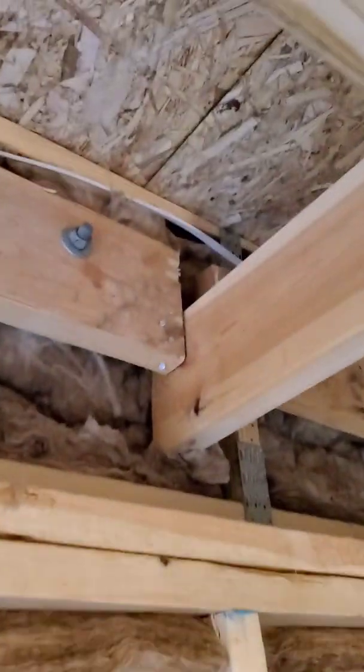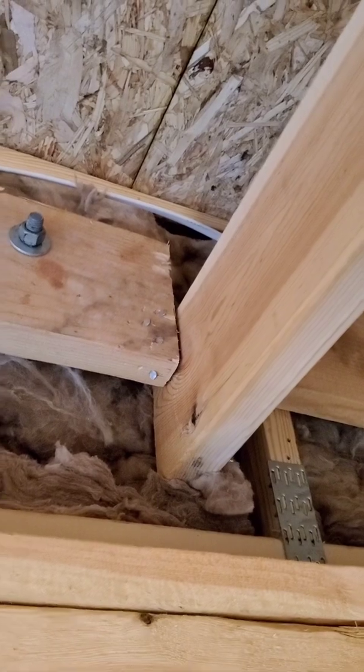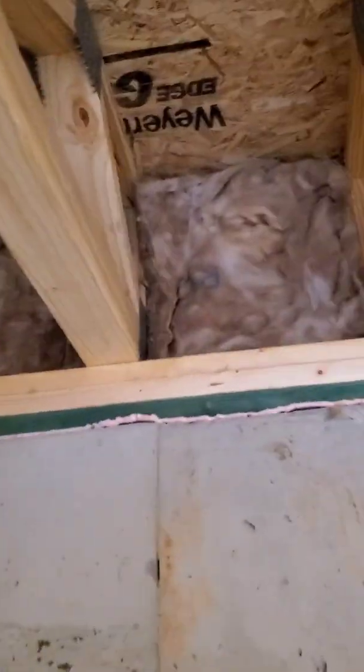So stay tuned. Okay, guys, we're down here in the basement now, and I'm looking at the wall, and the deck is running through these bolts. I want to show you right here. There are the lag bolts coming in, and that should have a sister joist coming from this part to that part, and here as well. So they got lag bolts installed, but the continuous load needs to be at that point to make sure that if the deck starts to sway or pull, it won't actually pull away from the house. So that's one little thing we want to point out.